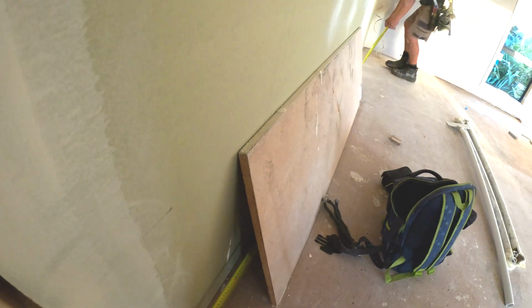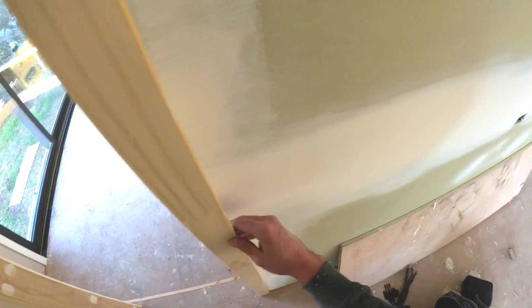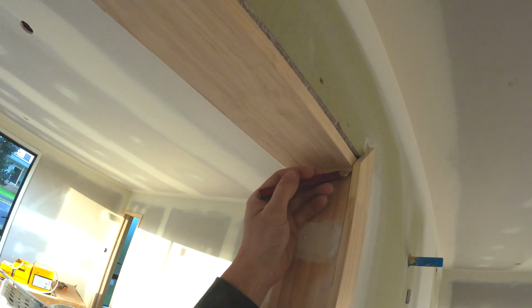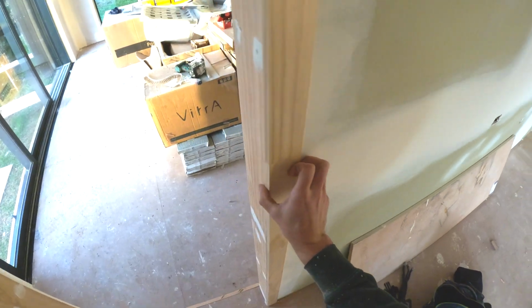Now, I'm pretty sure I've already done this, but I'm just checking with my architrave for 180. And that's going to give me my little line, yep. Now, I'm actually going to come off those marks about 2 mil, just to give a bit of tolerance in the kitchen play. So hopefully, even if I line it up with that. Okay, so we get there, 480. So I've got to take some off it, which works out kind of well because I've taken about 4 mil off that, so I might take 4 mil off this one and that should be good.